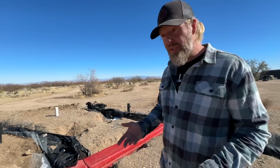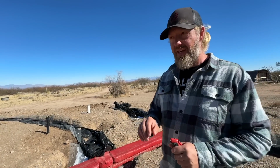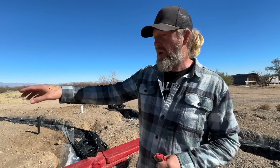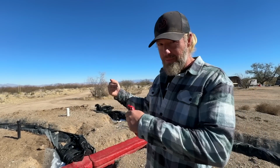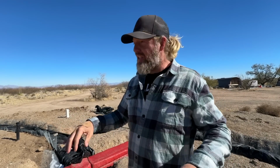So what we want to do is have those overlaps, but we also want to have a single layer that goes all the way across. So that's what this next layer will be. It will go over top of all of these intersecting walls. Then on the next layer, we'll break it up again. The next one, we'll do a single unbroken one. We just really like that extra security of having those long, unbroken, super heavy bags to hold everything together.